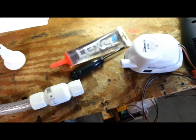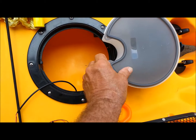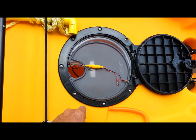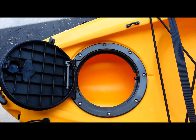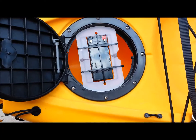Once we get it installed, I'll show you: my front hatch I currently use for my fish finder battery — the wires come up through the front hatch, I cut out the divider and the battery fits perfectly. So instead I'm going to use the rear hatch for the bilge pump battery. I just made a quick battery holder out of cutting board material with some tie wraps, and it sets right in there perfectly.